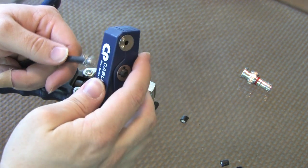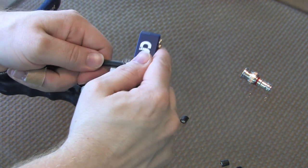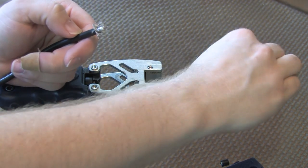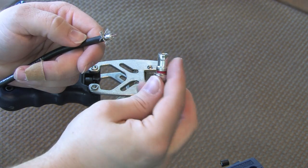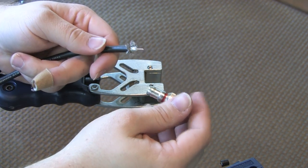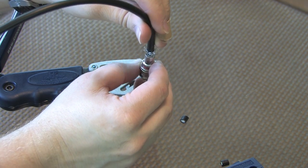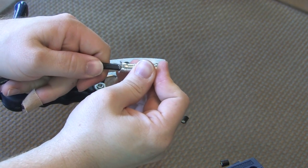Then I'm going to use the flaring tool on the side. I'm going to insert the cable into the flaring tool and push down to try and separate — get that jacket started separating from the rest of the cable. Then I'm going to take my BNC connection, making sure that it's red to go with my RG59 cable. I'm going to insert that center conductor into the pin on the back side of the BNC connection, going in straight and continuing to push in.